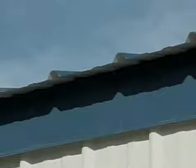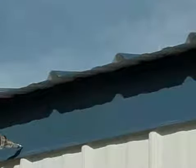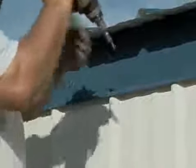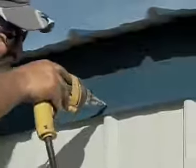This should catch the top edge of the eave trim. Now put one of the color coordinated number 14 by 7/8 inch screws through the eave trim and into the center of every other major rib of your sidewall panels. Do this all the way down each of the two eaves, and when you get to the end, make sure you have the eave trim overlap the corner trim, and of course you'll have to trim off any excess.